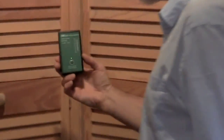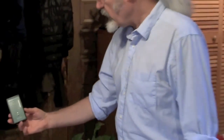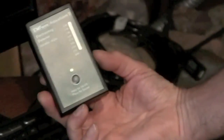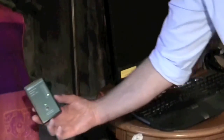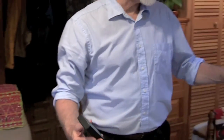Very low over here — in fact it looks like it's a little lower over here. The green LED at the bottom is not even coming on at all. Probably a little more tucked away from some of the sources. In this room a lot of the sources are mostly from the outside. Over at this computer, which is off right now — very little. So we've done a sweep of the room and I'm not finding any obvious source or any high fields. And sometimes you will, sometimes you won't. This is a very low field location. Yours may not be this low — I'm a little bit out in the country here and we don't have any RF devices in the house.